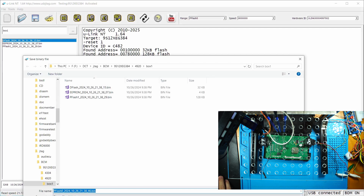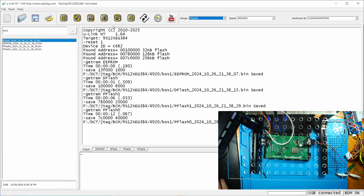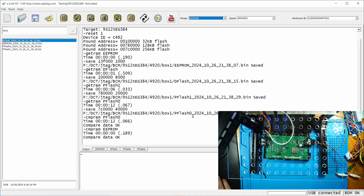Normally you should read twice for verification. I already know these are reliable reads, but you should read once and then verify to make sure you have a good backup. To clone box A to box B, you need to clone each individual tab. I'm not going to program this box — I'm going to program the last one with the external EEPROM, as the procedure will be the same.